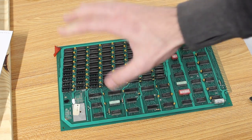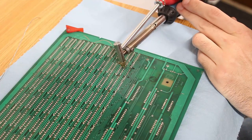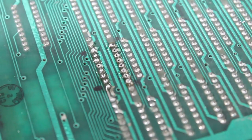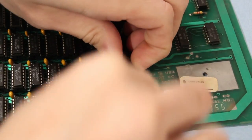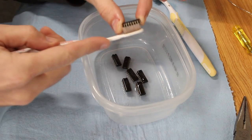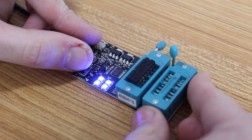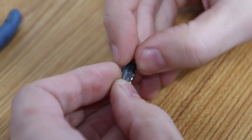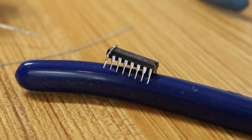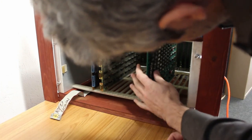We'll replace the bad socket and then give it a test. To remove the bad socket, I add new solder to all of the pins, get my hand desoldering iron out to suck out as much bad solder as I can, pry off what I can of the socket, then desolder the remaining pins one at a time. Once that's out and clean, a new socket goes in and gets soldered to the back. After scrubbing and testing the 4116s, I ultimately need about 10 replacements — so I bend up pin 8, solder it to pin 9 with a jumper wire, snip pin 1, and drop the 4164s into the sockets.